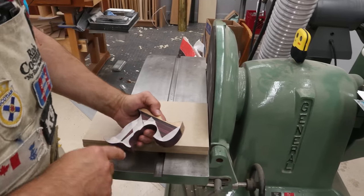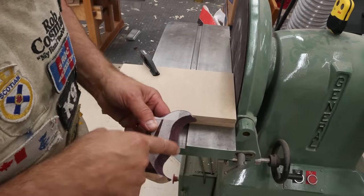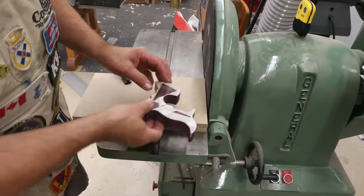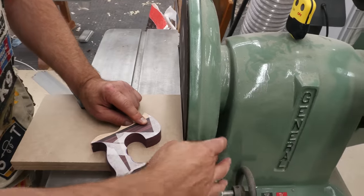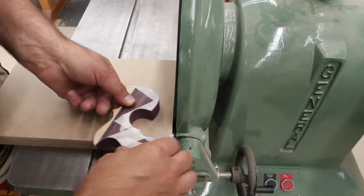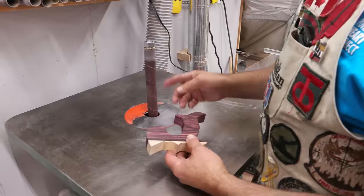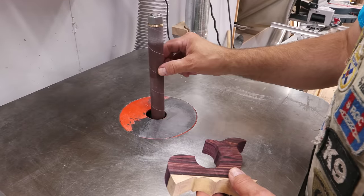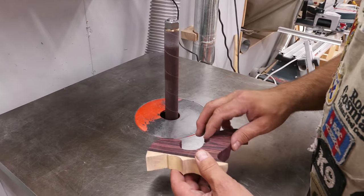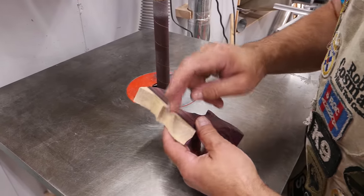Now the outside radiuses are really easy to handle. It's the inside radiuses — the ones you can't get at with something like a disc sander — that are more difficult, because I've got to do them with a small diameter spindle sander and try to make that curve perfect so there's no bumps in it. I had to put a piece of one-inch MDF on here because in order to get this nose piece, I've got to be able to swing over the top of it. This is an oscillating spindle sander — as it turns, it also goes up and down so you get to use more of the sandpaper instead of wearing out one spot. I'm going to start with a coarse grit, go to a medium, and then a final finish grit. The rest of these surfaces are going to be shaped with the router, but these two can be finished here.